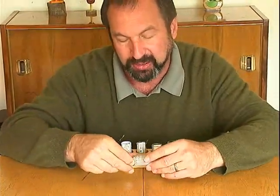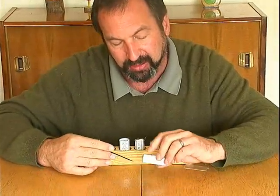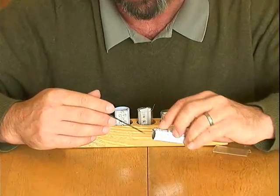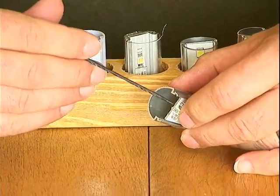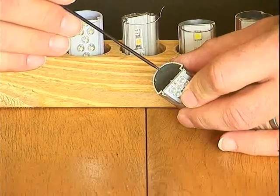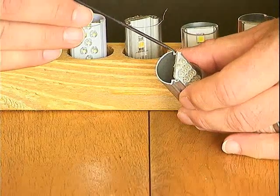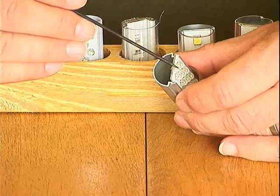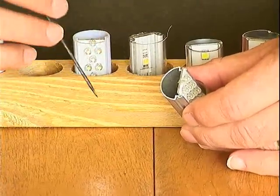Then we get to a variation of that design. You got another 5mm dip package. And to look at it, you see the aluminum half shell and you're thinking, oh, this isn't so bad. But then, if you notice, that aluminum does not come all the way across, and as I mentioned a minute ago, having these dips doesn't really lend itself to bonding it to that aluminum on the backside. So the printed circuit card is merely held in these 2 little channels. The only way you can get heat out of that card into that is through this very slight contact at the edges.